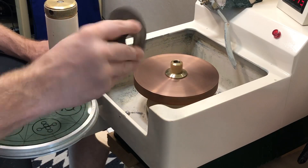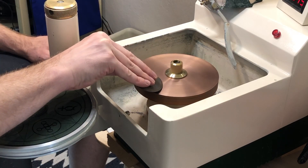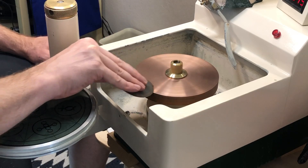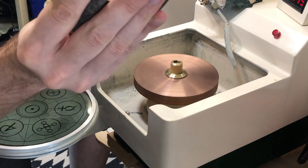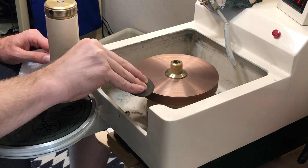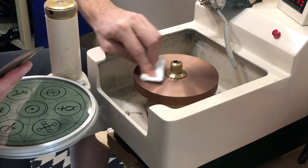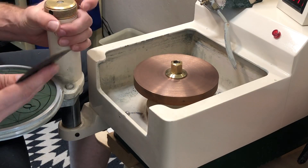If you were having some contamination problems, you can skim off the top layer. I'm folding the blade a little bit so it gives me a surface to hold on to, then just skimming off the top layer with the edge of the blade — going back and forth. You just want to keep it running, don't gouge it or take out more in one spot than another. Some copper will come up off the lap. You want to do it evenly — that's cleaning it, that's skimming off the top.